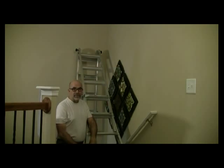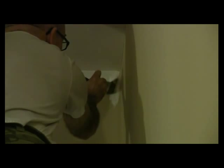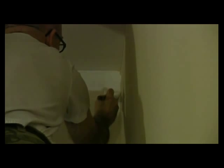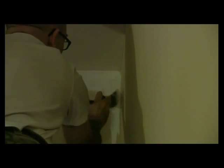There are different ways to cut in. One is freehand - just take a little bit of the lead of the paint where it's wet, go up there real slowly, and do it freehand. Just take your time, feed that right to the corner. The art behind this is to take your time, don't get in a hurry. Use a little bit of paint, draw a straight line down, and keep moving it over until you come in contact with the corner - just feed it in like that.